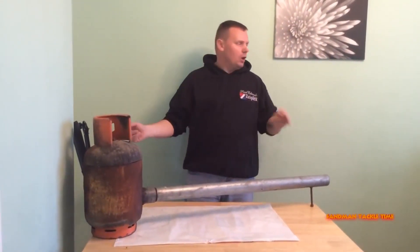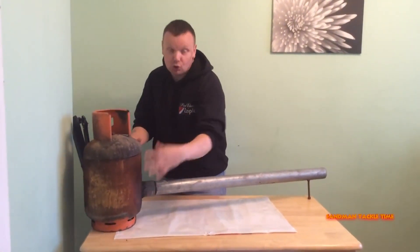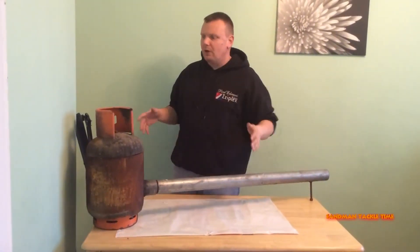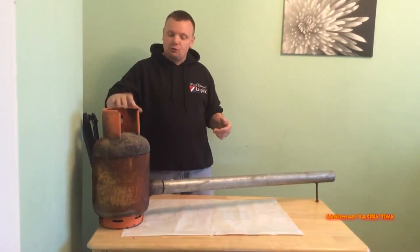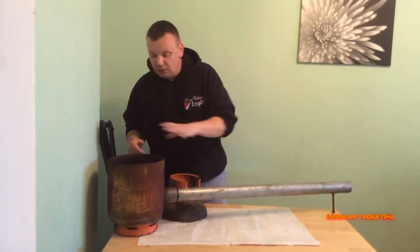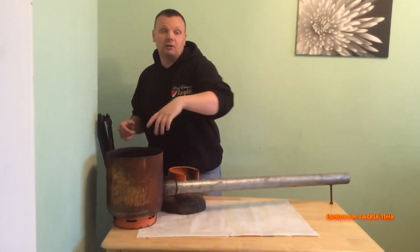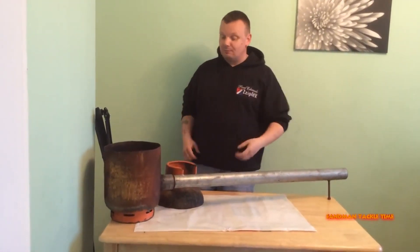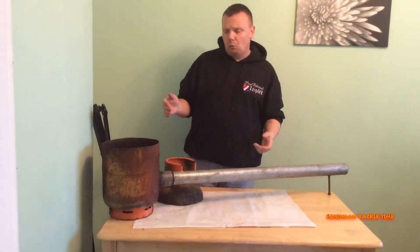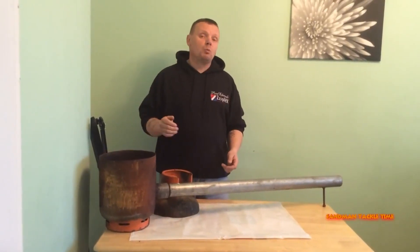So you keep the pump going, stand well away from it, and leave it for a good length of time. This furnace was glowing bright red — absolutely piping hot, you couldn't go anywhere near it. You use welding gloves. Take the top off periodically to check on your aluminium, and if need be pack more briquettes around it, keeping the air on it all the time. After a while — I can't remember exactly how long, but it was around half an hour or so — your aluminium will melt.